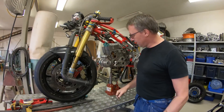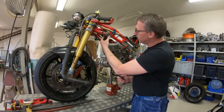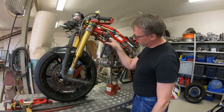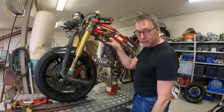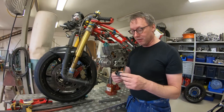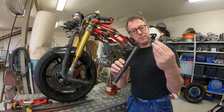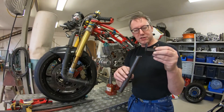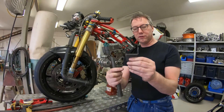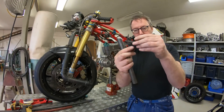I've machined the upper part of the engine mount here, and the lower bushing is already in place. There's supposed to be a tube connecting these two. I chose to make this as a hinge so that it will be possible to flick this engine mount a little bit to the front to ease assembly and disassembly of the engine. I have used this specific design before, but then I had problems with this rod pushing up and down from the movement of the piston in the engine, causing cracking here.